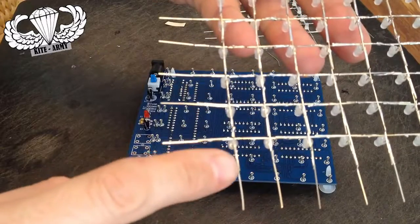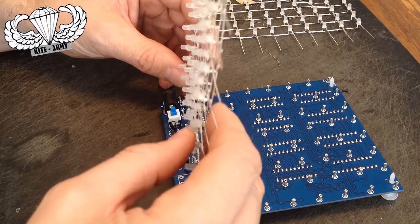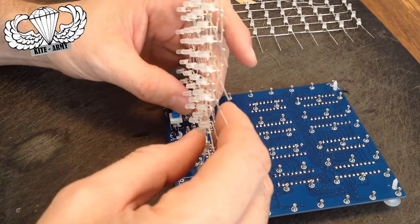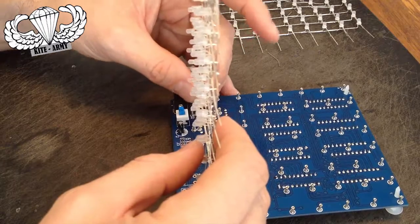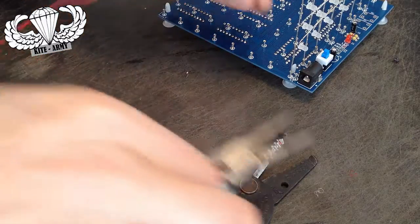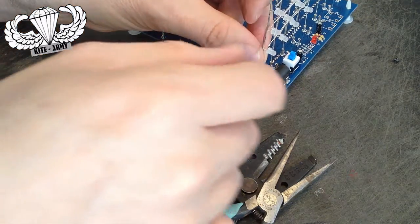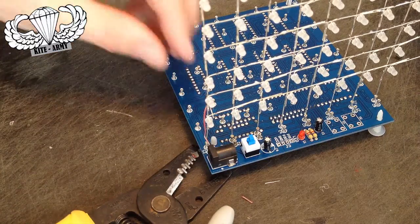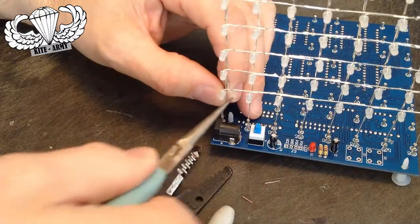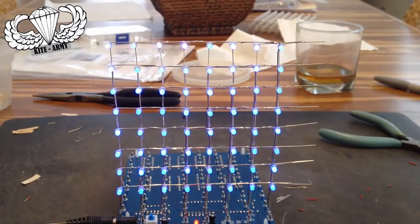Here it is doing some of its magic. At this point I feel like my board's functioning the way I expect it to, so I'm going to start mounting my grids — just work them into those little connectors real gently. You'll notice the pieces hanging over on the right connect your layers of your grid, so what you're seeing near my right hand will actually connect to the next grid once I install it. To connect the layers, at the front here there are two connectors — one goes to the leg of the grid and the other connects to the layer. The kit includes some wire, which I colored with a gray Sharpie so it wouldn't stand out. Here I am connecting it to my layer — you have to do that all the way across for all eight layers.